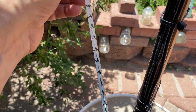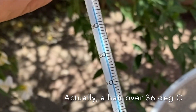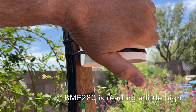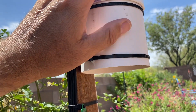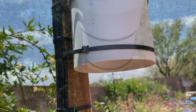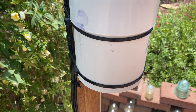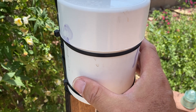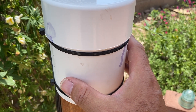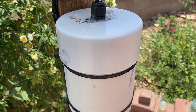I've been holding this thermometer out in the ambient air, pretty much in the shade, and it's just a hair under 37 degrees. This box is warmer than the ambient air temperature, so it's probably picking up heat and biasing my results. One way to remove that bias is to hacksaw off this piece and move the sensor up, so I don't have all this thermal mass getting hot in the sun and creating a hot bubble of air biasing my results.